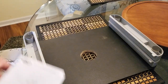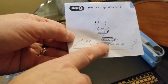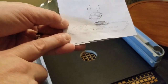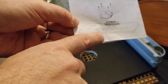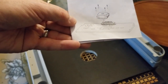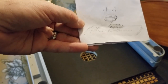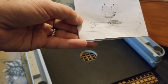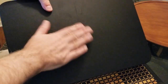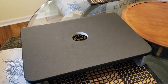And if you take a look at the Arcade 1-Up unit picture here, you can see that in that unit there is an inset for the trackball. And they have the rest at, I don't know, probably about a half inch, three-quarter inch width of the actual plate, but it's probably bored into here by that router by at least, I would say, quarter inch, maybe a little more than that. So we'll try to bore into it, and then the trackball will sit up all the way out of this hole so you can access it freely. All right, so that's the plan. I'm gonna be sending this off to my buddy. We'll see how it comes out, and hopefully you'll have it back in a couple days.